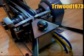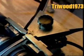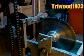Workers now feed two tapes with metal teeth into what's called the joining machine. The teeth interlock, meshing the two halves of what's now a continuous zip. From there, it's onto a cleaning machine, which first washes the zip, removing any shards of metal left behind by the tooth cutting process. After drying the zipper, the machine applies a coat of hot wax. This lubricates the teeth, so the slider will glide over them smoothly.